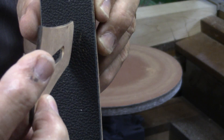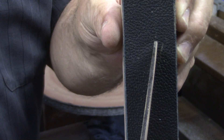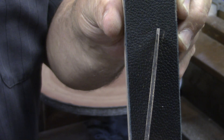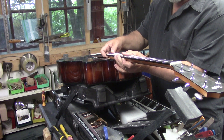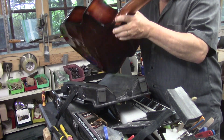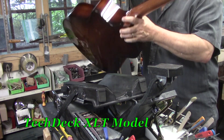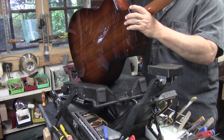Let me just back this up — here's full thickness on this end, and we've tapered it down considerably. So we'll put it back on the guitar, assemble it very quickly, and check that neck angle. I'm going to put that neck back on, snug it down loosely, and we'll put the two bolts back in, just kind of finger tight.